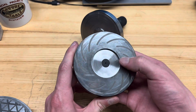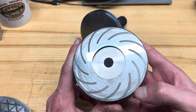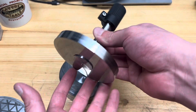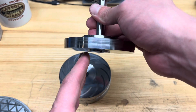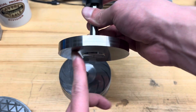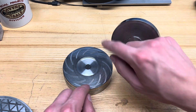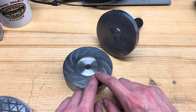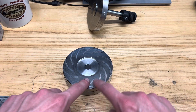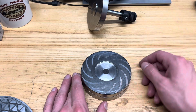You can feel them, but they're nice and smooth and consistent at this very shallow depth. The mechanism is a bit different from the tilting pad: as this rotating plate spins, you have a boundary layer of air on it, and because air has viscosity, you have a no-slip condition on the plate. So it drags air through these grooves as it spins. The air is moving through, getting dragged by the plate, reaches the end, has nowhere to go, piles up, builds pressure. That pressure pushes up and leaks onto the rest of the bearing land, and supports and lifts the thrust plate up.